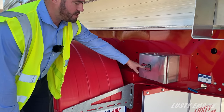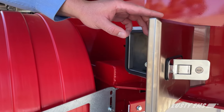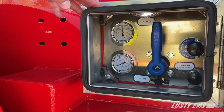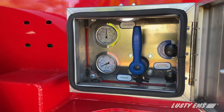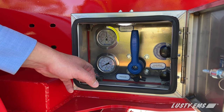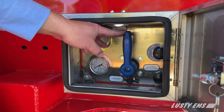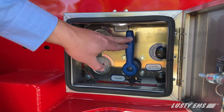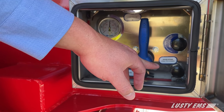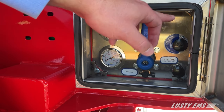The Stag lead has a stainless steel control box. In this control box is a pinch seal to help seal the box from dust, dirt, and grime getting inside. In here we've got, on the left-hand side, a pressure system gauge, an airbag pressure gauge at the top left, raise/lower valve, reset the ride valve, hydraulic door down switch, and a park brake emergency release which releases the brakes.